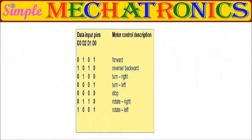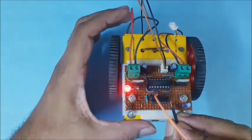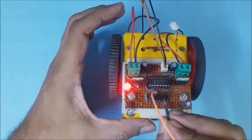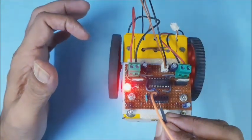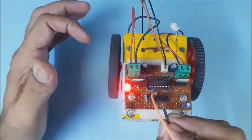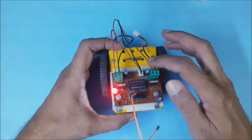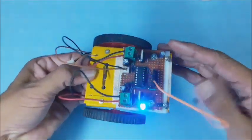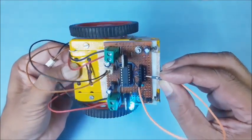These are the 4-bit codes used for motor rotation control, available at the 6-pin connector. Now test the direction of rotation of the wheels by connecting 5 volts to each pin — 4 out of 6 pins in the connector. Note the rotation direction as per the forward and reverse codes, then reverse the motor connections if required. Then confirm the direction of rotation after updating the motor connections.